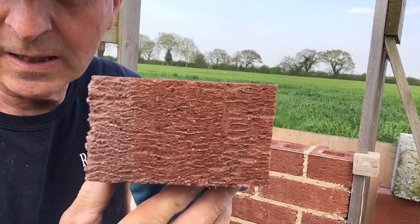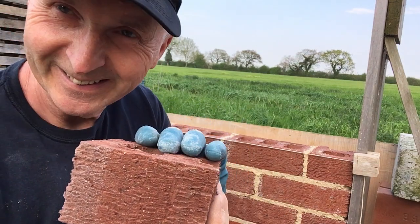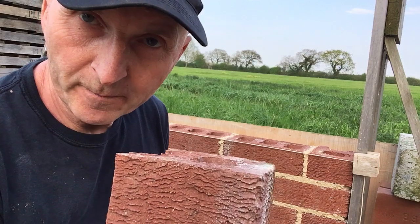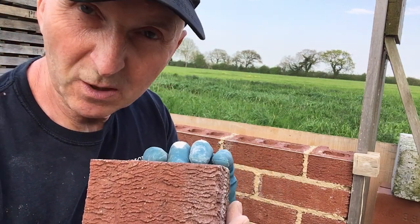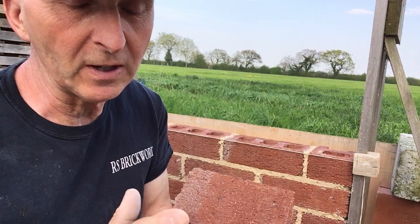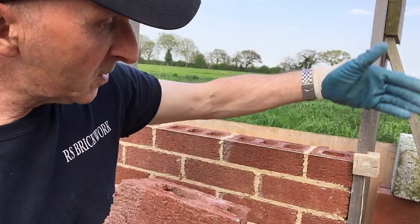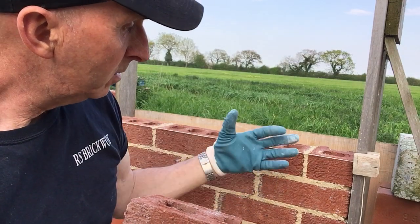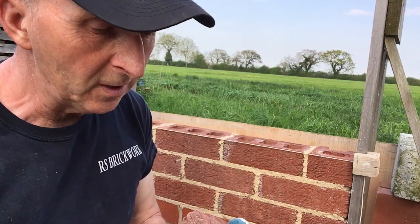When we were students we were told that water would get in, freeze, and then blow the brick. I did a repair job for somebody and put a lintel in - they had a buff wire cut brick, similar design to this, and I'd say 20% of the bricks were laid the wrong way up. The houses were built in the early 70s and there were no effects. That's not to say you can lay them that way up, because they do look awful. When the sun shines down and gives a nice shadow on the face, the ones that are the wrong way up just look darker - you can tell straight away.